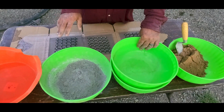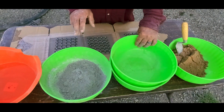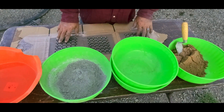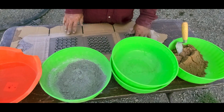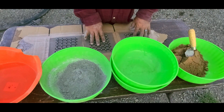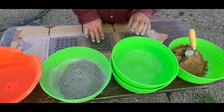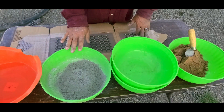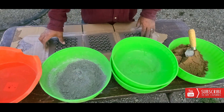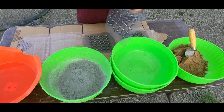This is designed to go on thin for coloring and a final waterproof hard coat. The experiment I'm doing here is to test how well these ceramic beads act as a thermal barrier. I'm going to do three experiments: a control which will be just sand and cement, a sample with sand, ceramic, and cement, and a sample that'll be just cement and ceramic.